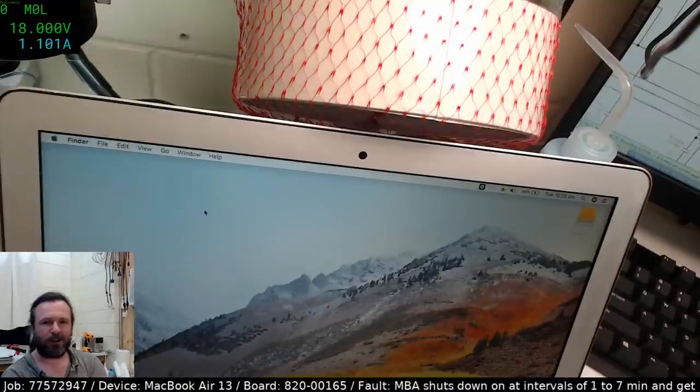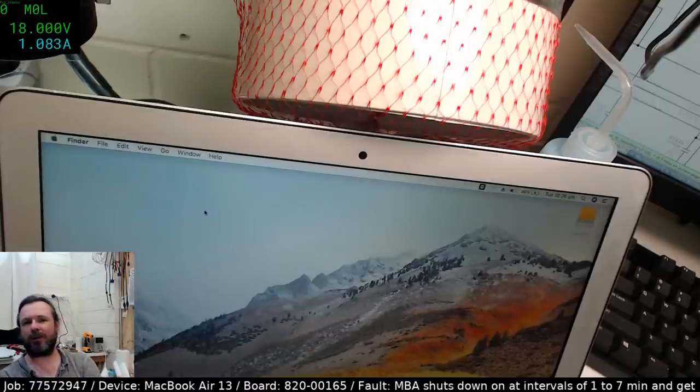If you can't get the back plate off, I'm a little disinclined to say this, but maybe it's actually stuck, in terms of it's got goo in there or something like that. I would see if you can at least lever up some of the corners to get some lift. It may be just that it's bonded to some of the plastic. That's my guess. If you can't get the screws out, that's all the more fun. You may have to push down around the screw for a little bit just to relieve the pressure off the head. If you've already stripped the screws out, you may have to drill the heads off. But that's not going to be any fun.